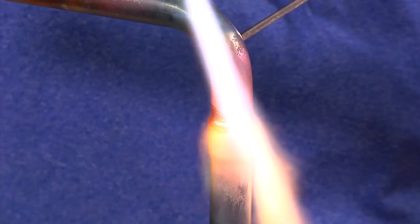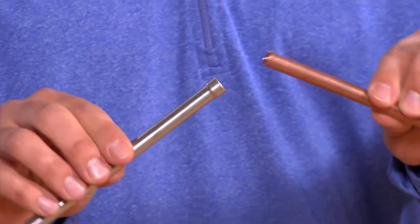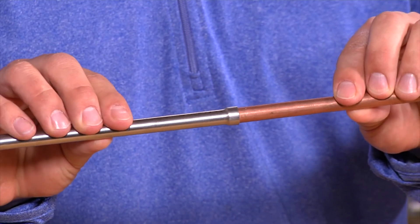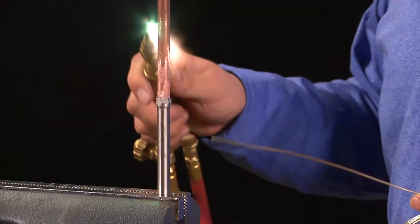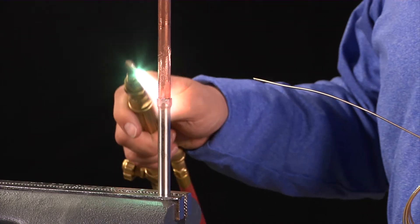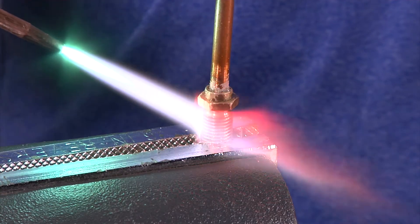You also need to take into account that metals expand when heated, especially for concentric assemblies in which dissimilar metals are joined. The allowance you should make for expansion and contraction depends on the nature and sizes of metals being joined and the configuration of the joint. Although many variables are involved in pinpointing exact clearance tolerances for each situation, just remember: different metals expand at different rates when heated.